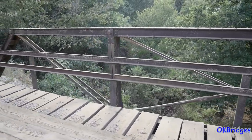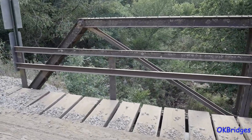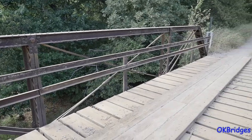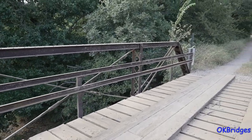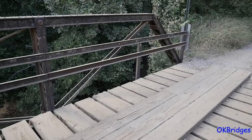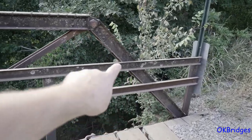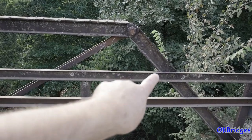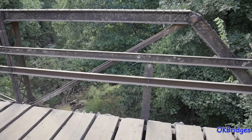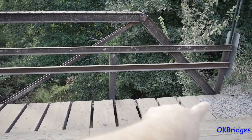You can hear the cows in the background — he's actually feeding cows. I wanted to make a little addendum here to share why this is called a half-hip pony truss, because you'll often see these three-panel pony trusses and they come in two flavors: either the half-hip or the full-slope versions. The full-slope versions are usually called a queen post truss. The half-hip refers to this arrangement where the end post is nearly vertical relative to the panel length, and then you've got a long diagonal — it's almost like the end panel of a Warren truss. On a full-hip truss, which would be a queen post, the end post starts down at the pin at the bottom and runs up to the first panel joint.